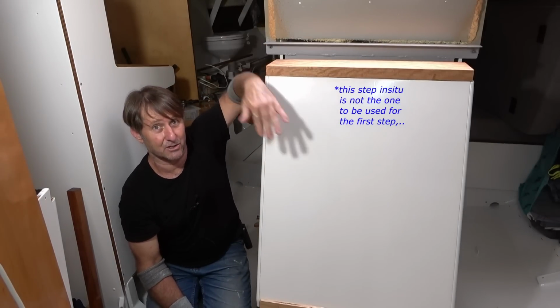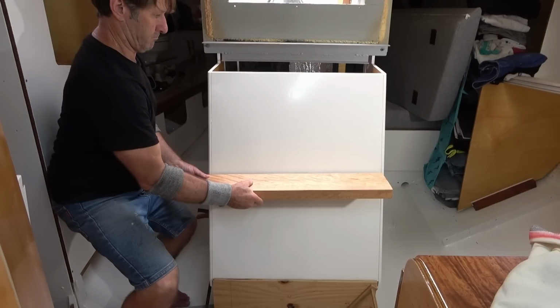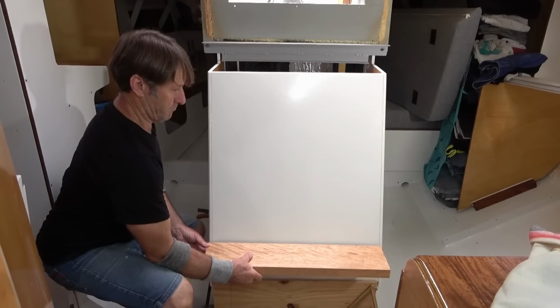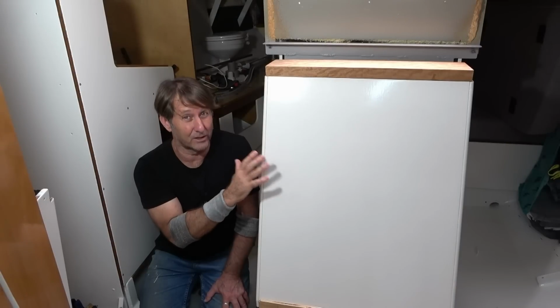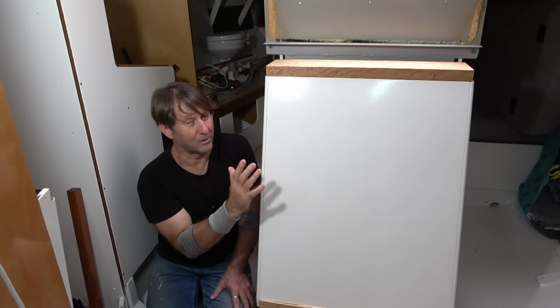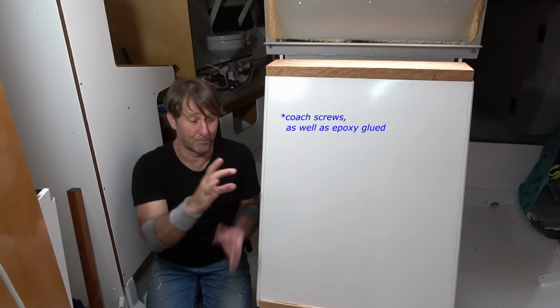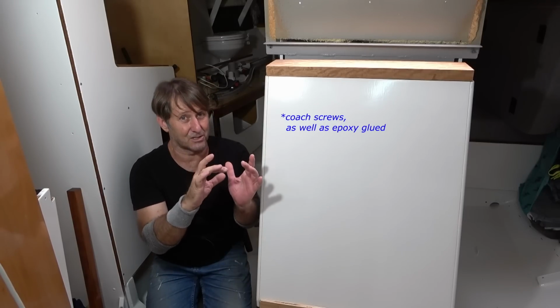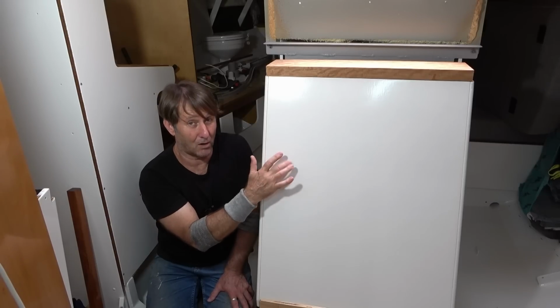And that's important because it's going to be off the leading edge of this initial step that this whole box is going to hinge. There'll be 3 steps, as you can see, placed evenly, all matching in the same bit of rosewood, and it's that different grain with the rosewood, kind of like that tiger grain that some woods have. And they'll be fitted by long coach bolts through the back with very large stainless steel washers so that those coach bolts are spreading the load behind the marine ply.